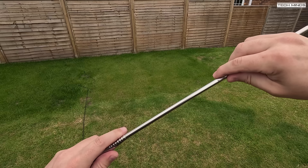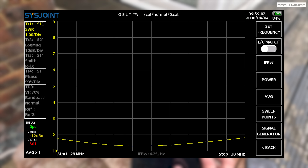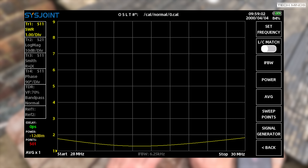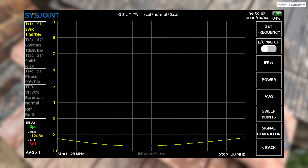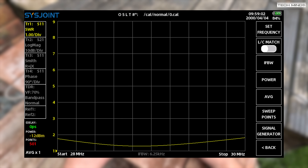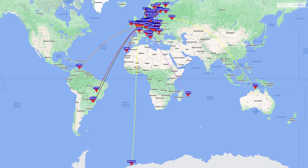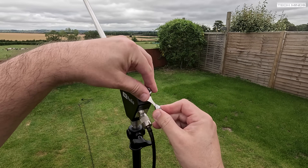Back to the antenna again to adjust the elements for the 10-meter band, which spans 28 MHz up to 29.7 MHz. Seeing the dip in the center is expected — for the SSB portion I would lengthen the element slightly, and for the FM portion it's still usable below 1.8. After running WSPR for a few hours at 5 watts, my transmissions were being picked up in South America, Antarctica, northern Australia, just off the coast of Madagascar, a few inter-G stations, and a large number of Western European stations — so it appears to be working well on 10 meters.